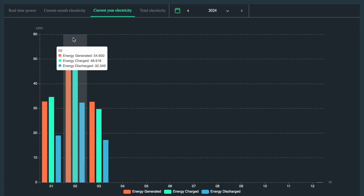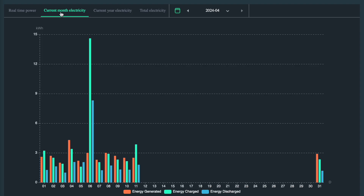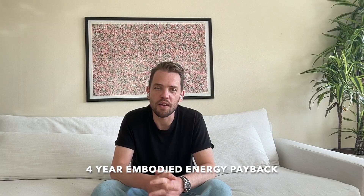I know that it'll be a two-year payback for me because I pay roughly 55 cents a kilowatt hour. For most people it'll be more like four years. The carbon payback will also be about four years, meaning that after four years we'll have generated more energy with the system than it took to make the components — that's the embodied energy. Solar is now a self-installed consumer electronic. It does come with some real downsides: you need to lay your own wiring in your home and be aware of the max wattage of those wires. The window gap solution that worked for me may not work for all window types or in all climates. But it's possible, and it's getting cheaper and easier every single day.